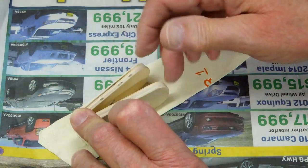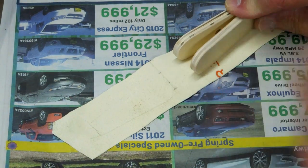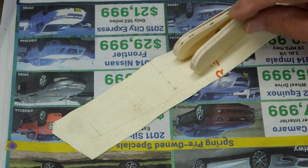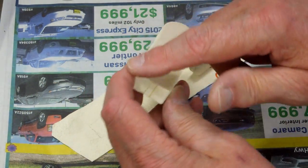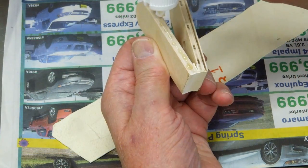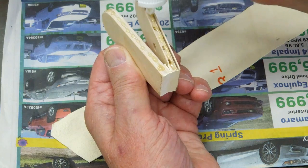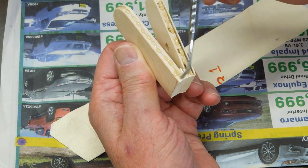Spread some more fish glue on this side. I'm going to roll that around and put it on like that. Push everything down firm when it dries, then come back and trim this off. There's really no difference in doing this than when we made the bellows of the reservoir for the Senior 20, or any other organ.